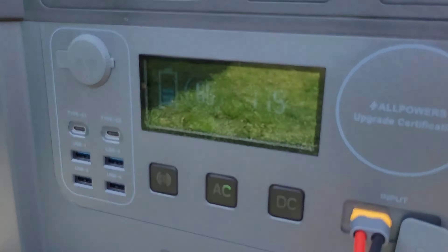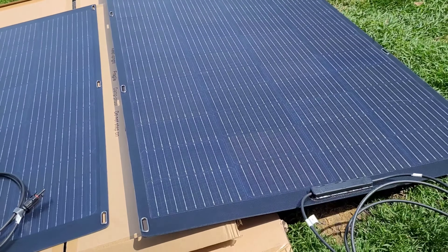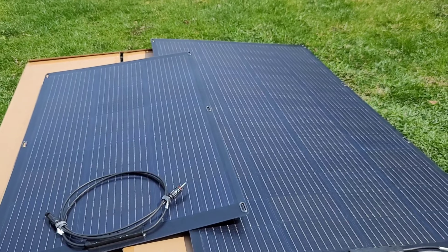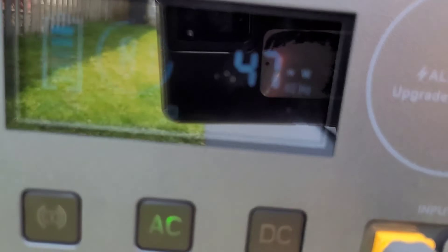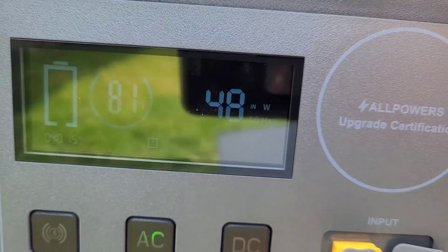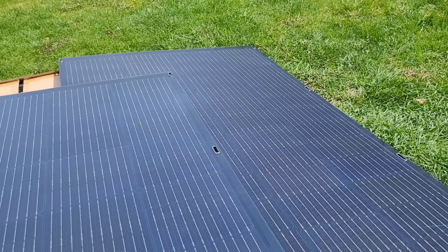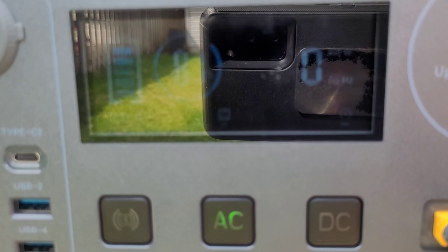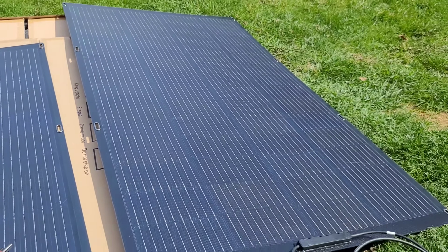The clouds are rolling in, so before we lose too much more sun I want to test how this panel does in partial shading — obviously a big factor for solar panels. We're going to take the smaller panel and put it over different parts of the larger panel to see how it reacts. Covering one strip of cells on the side cuts us down to around 50 watts — not too bad, we did lose some performance. Let's see what happens when we cover the second row.